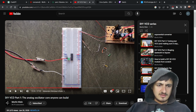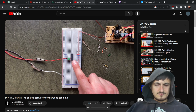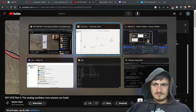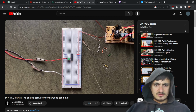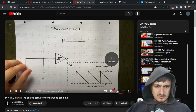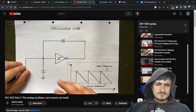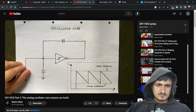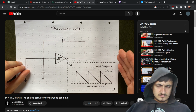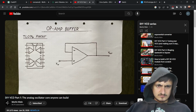You might be tempted to just attach an audio jack socket right where we plugged our oscilloscope in. Generally, that's going in the right direction, but sadly, it won't work at all. Our capacitor is never being charged because all of the current is leaving through our audio jack. So by trying to listen to the oscillation, we're actively stopping it because we are tampering with the construction of the whole thing. To avoid doing that, we will need to use a buffer.